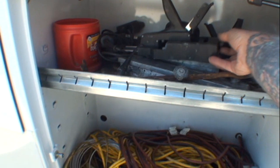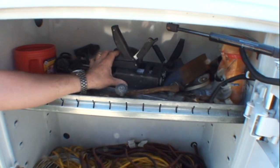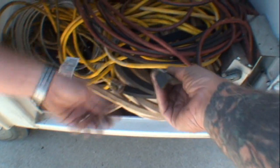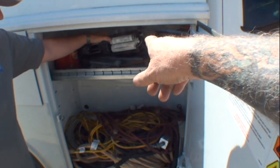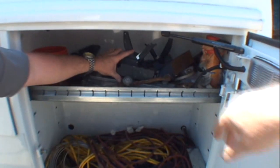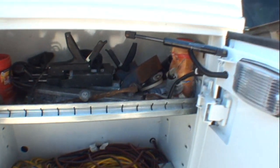What's this tool — looks like a caulking gun? This is some adhesive glue. All these belts have to have some sort of tracking system. What we use is this material called V-rope — look how thick that is. I glue that to the edge, about two or three millimeters off the edge of the belt. It stays on there, never comes off. It's some strong industrial glue — it's all in German and it's top secret.